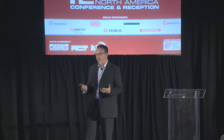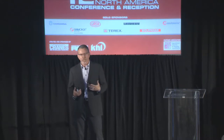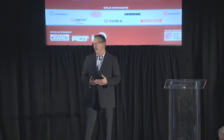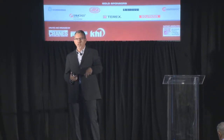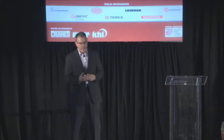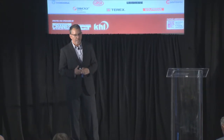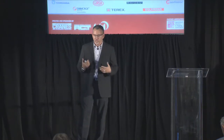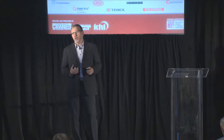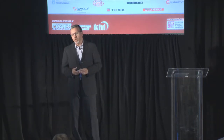When they're erected, they look a lot like a normal tower crane — there's a vertical mast that goes up and down, a horizontal jib, a trolley that goes in and out to change the radius, and the crane swings left and right. But that's where the similarities stop. The biggest differences are that self-erecting tower cranes swing from the bottom — they're bottom-slewing tower cranes. They set up on outriggers, so instead of using a concrete foundation they set up much like a mobile crane does, and you can adjust the heights to get the crane perfectly level. Also, there's no counter jib — the jib is held up by suspension going up the rear of the tower, which has advantages for avoiding obstructions.